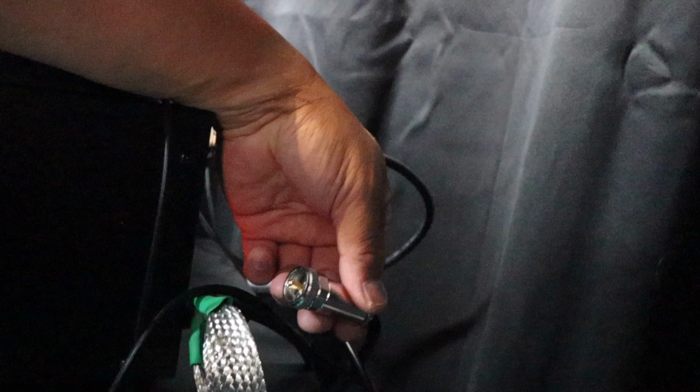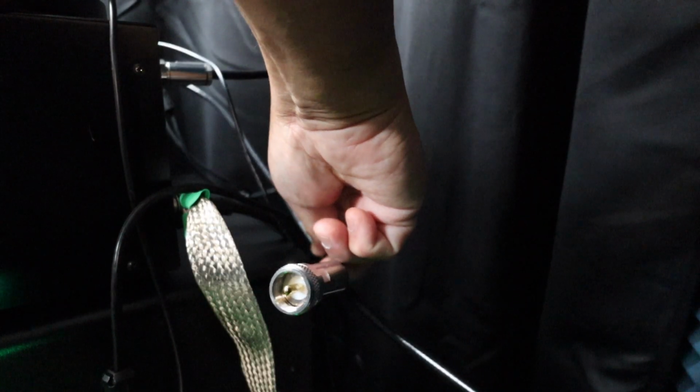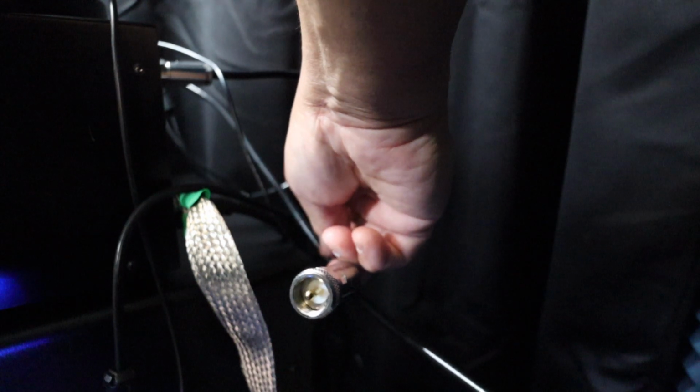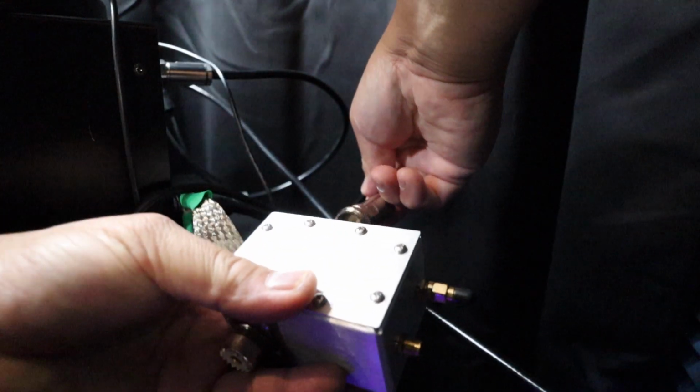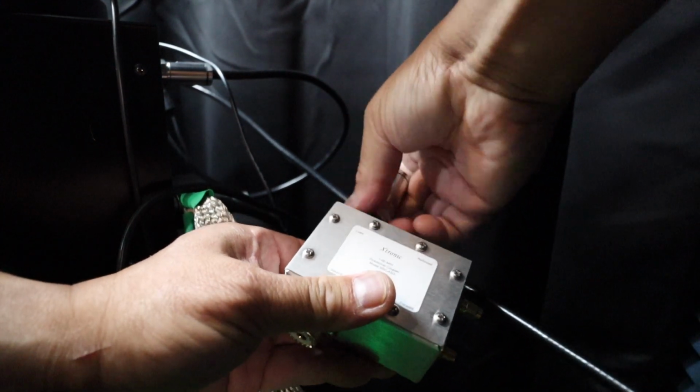This antenna coax here, the Messi & Paoloni, this is my sky loop. I'm going to disconnect this one and add the RF sampler after the tuner. This goes all the way to the second floor of the roof. That's my antenna, the sky loop, 40 meters. I'm going to connect that to the load on the Xtronic.